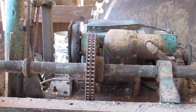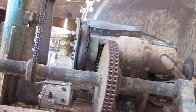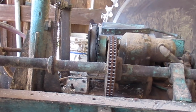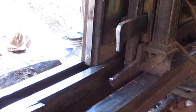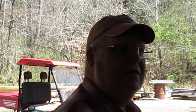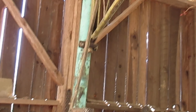That round thing you see there on the edge, that's the brake that holds everything steady so the carriage don't move. It works good. There are just three buttons and a lever that I run with my left hand - one's forward, one's reverse, and one's the setworks. When I hit that setworks it comes out the same amount every time. That wire right there travels back and forth - that's what hooks it all together. It's just a real simple setup.